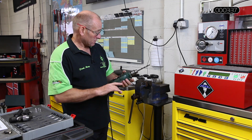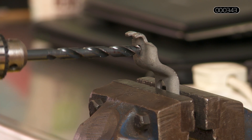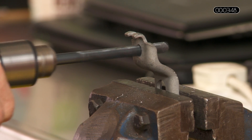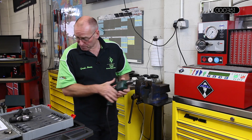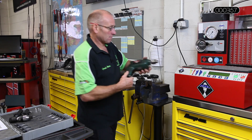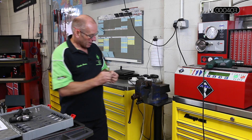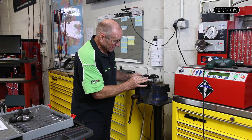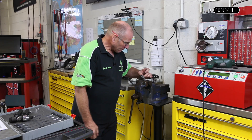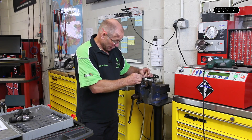The glasses I'm wearing are reinforced, so they do serve as safety glasses also. The first step is to open up the hole to the appropriate size. Just check the size — you want a nice snug fit. You don't want too much excess because the rivet is going to be pulled from behind, but you want the sleeve to be quite a snug fit, which it is.